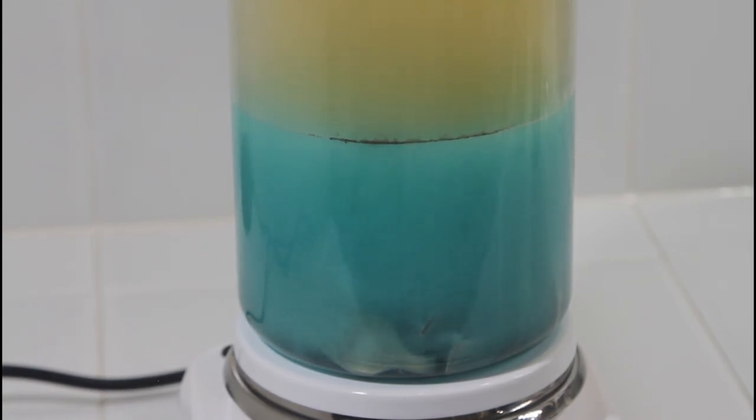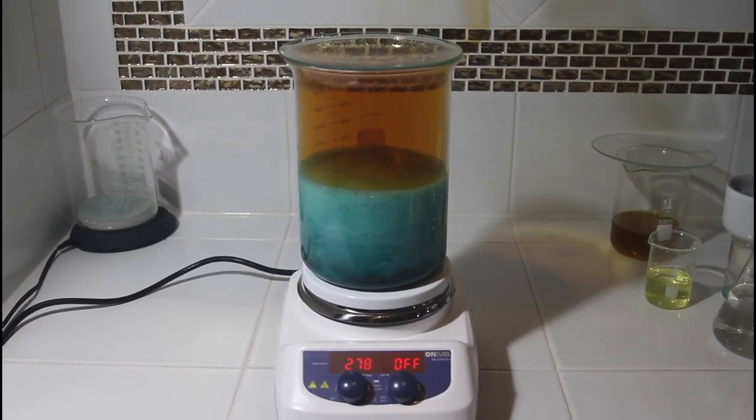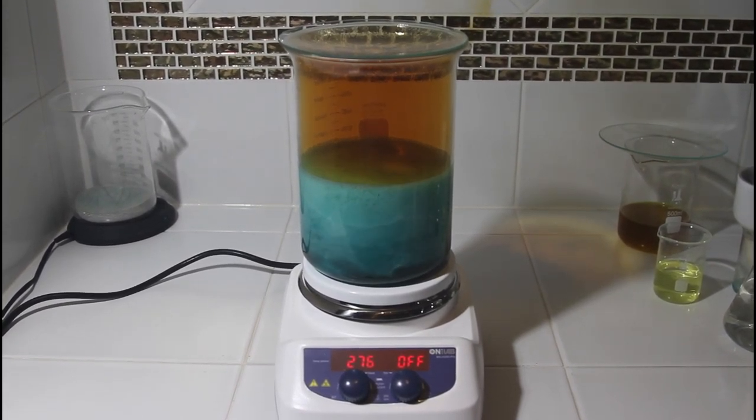So as the nitric acid reacts with the sterling silver, which is 92% silver and roughly 8% copper, at an atomic level, the ions are actually being bumped off the piece and they're being displaced into the water, which creates a gas, nitrogen dioxide, which is that maroon gas that you see hovering above the solution.